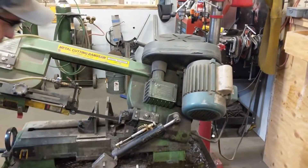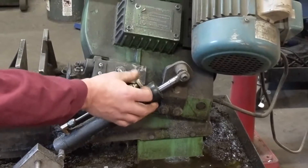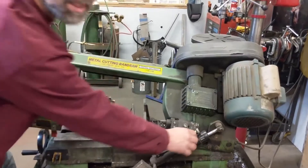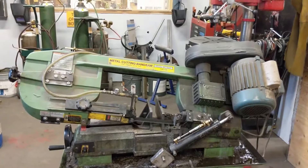You need to run this valve here — it will allow the saw to bleed down. This small valve on the end will adjust your speed. Typically, slower is better. You'll make the blades last longer and end up with nicer cuts, especially when you're doing miters.